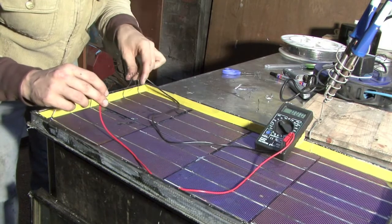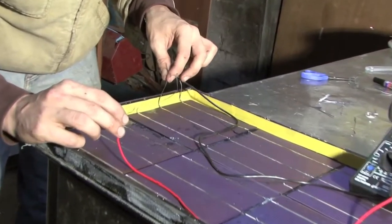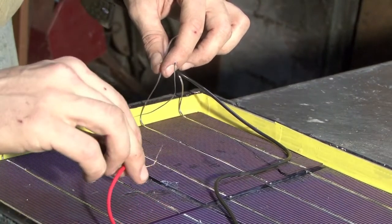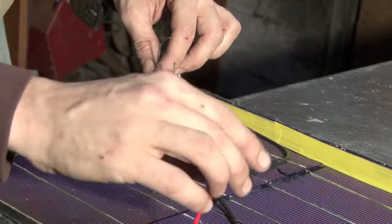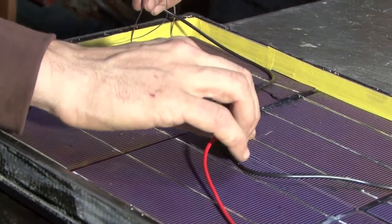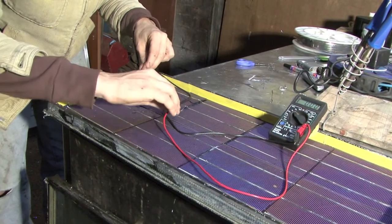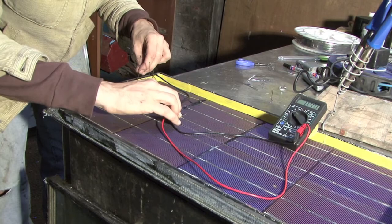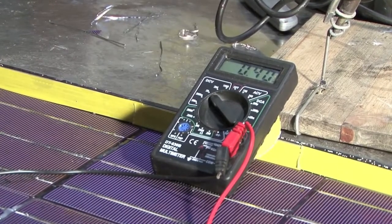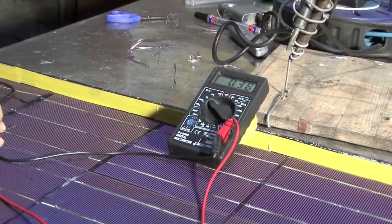So I'm going to put one wire over here on the top of this cell — that's then the negative. And I'm going to put this one on the wires coming off the bottom of this cell, which of course go on to the top of the next one. So I'm merely putting the wire on the top of one cell and then the top of the next cell. That means I'm measuring the voltage across this cell — top here to the wire coming off the bottom there. And as we can see, I'm getting a reading of about 0.4 volts, so that means that that cell is working. As we expected, it's just under 0.5 volts because we're inside and not under full sunlight.